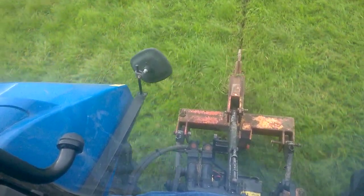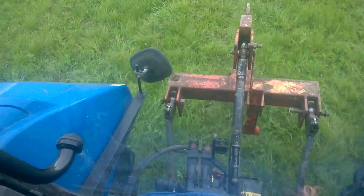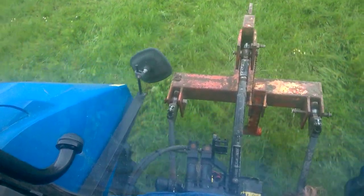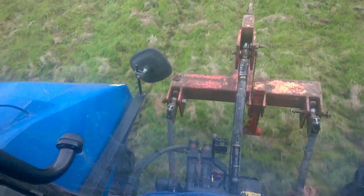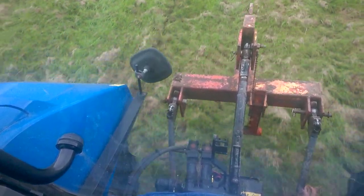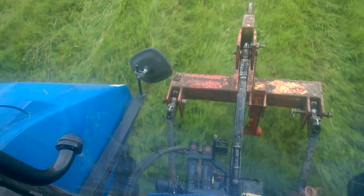The only downside — I'll show you in a minute when I go back up. So I'm basically driving back over. What I've done... I've just firmed it back in, and it also gives me my next line as a guide. I'm doing this every six, seven foot with the tractor. I'll run up the field, run back down with one tyre on what I've just done, which firms it back in, or gives me a mark on the other side to put my wheel in again.